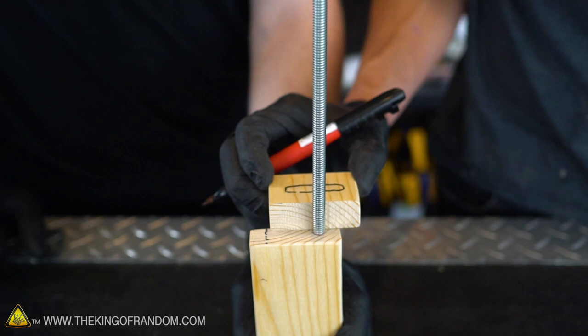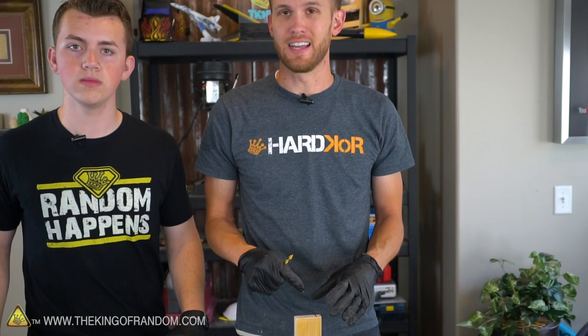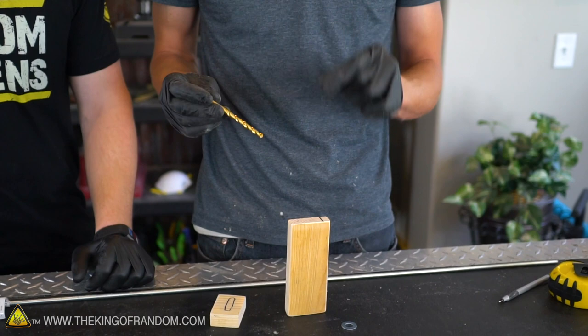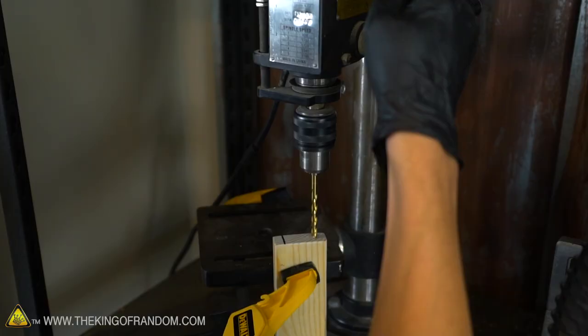The all-thread will be able to slide back and forth until we fix it down in place with the wing nut. We've got 5/16 inch threaded rod, and what we want is for that rod to be in this block super tight so it's never going to come out. We're going to drill our hole using an even smaller drill bit — this is a 1/4 inch drill bit. One quarter is four sixteenths; the rod is five sixteenths, which makes the rod a tiny bit larger than the drill bit so it should bind in there really tight. We need to drill a hole into the block right here.